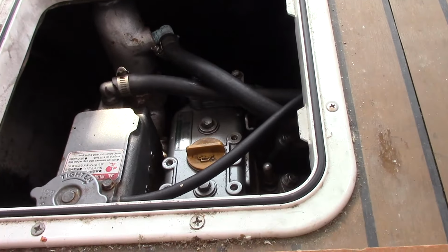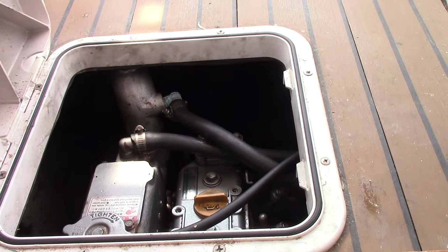But now, while I'm cooking, the steam has somewhere to go. Now, my engine. When I got the boat, the only access to the engine was through the area in front of the companionway. And to change the oil, or to put new oil in, or to check anything, almost impossible. There's like this much room between the engine and the cockpit floor. So I just cut a hole out, put a hatch in, and I don't know what I would have done. I don't know how I would have gotten the fuel injectors changed had I not done that. I would have had to do it at that time, or they would have had to pull the engine out to get the fuel injectors out. So to me, that was very, very important to get done for maintenance and to keep everything running right.